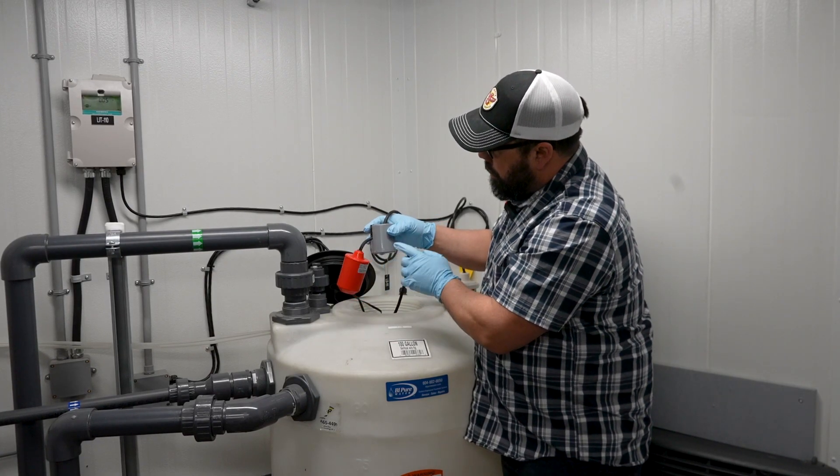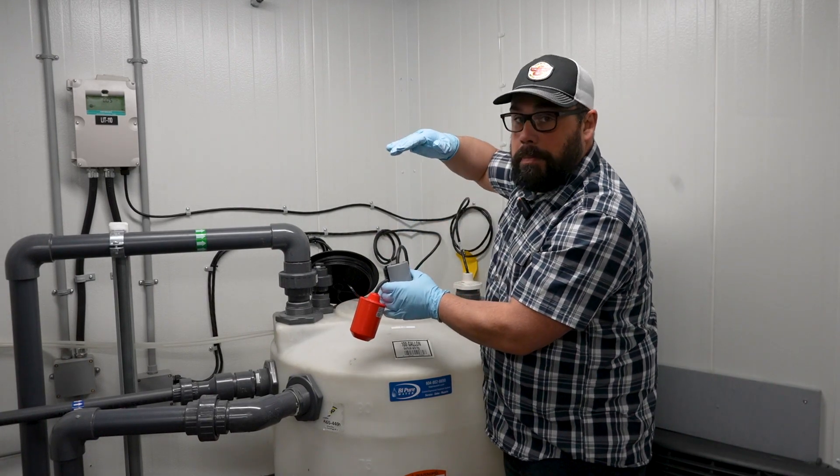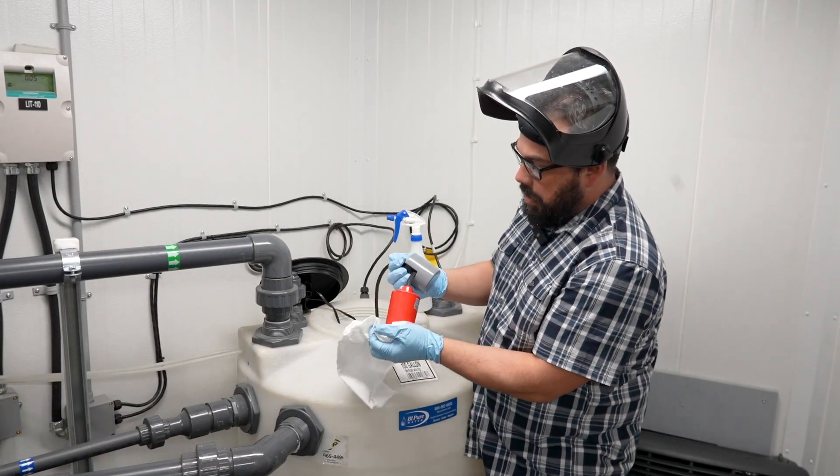You can adjust your weight height in your tank to bring your float up and down and give it more travel. Then wipe these off, make sure they're all clean and there's no crud stuck on them.